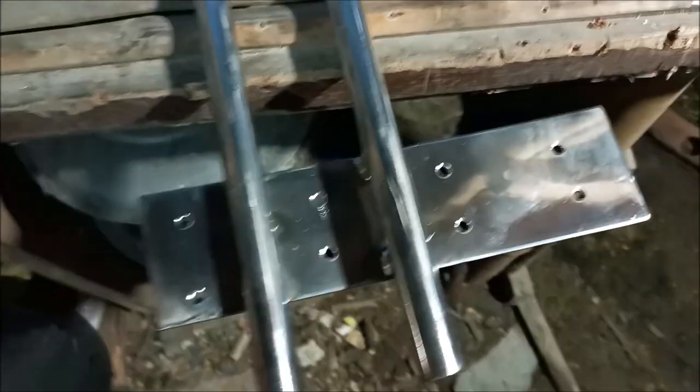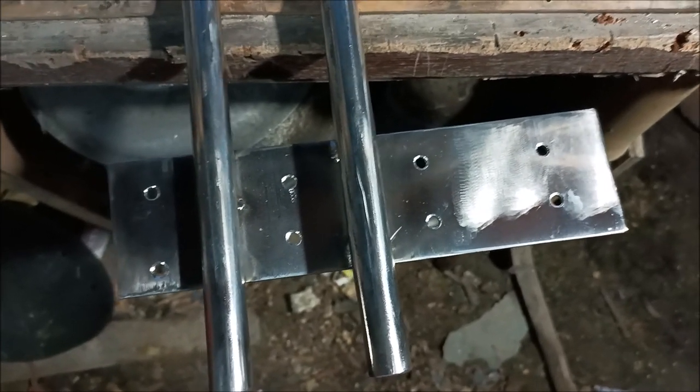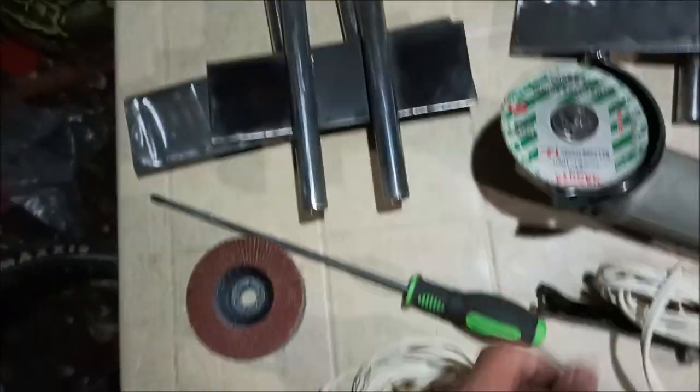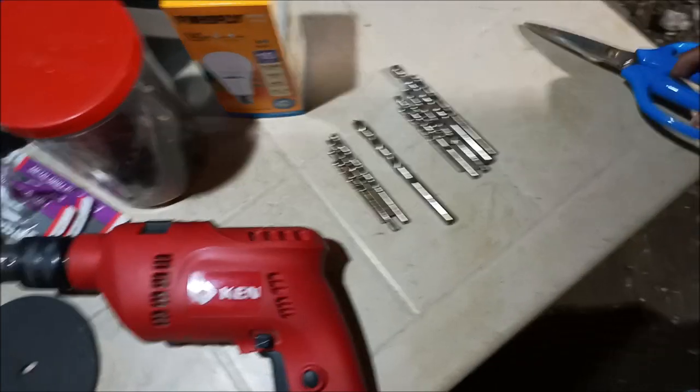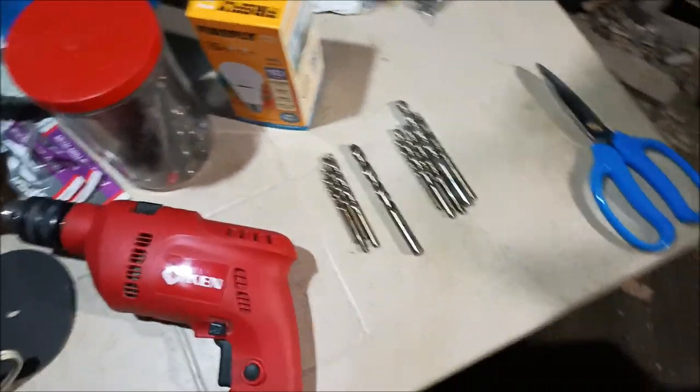That's my work cut out for me tomorrow. I got all these polished today and got this one drilled — that took minimum an hour to an hour and a half to drill eight holes. Some of these larger tab ones may need 10 holes and some of the smaller ones only six holes. I've got plenty of cobalt bits here and hopefully we'll get through without buying more. The good news is the handyman store is actually selling these — a 3/16 is 115 pesos, a 1/8 inch is only 63 pesos.